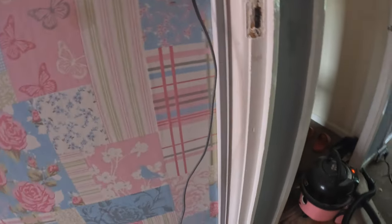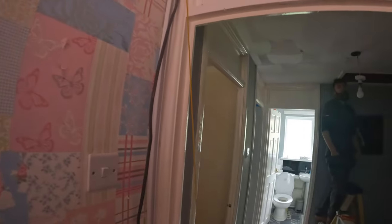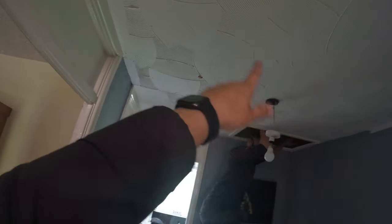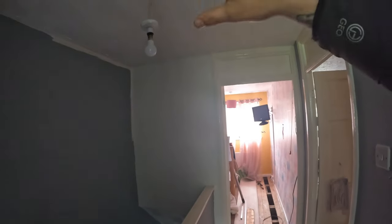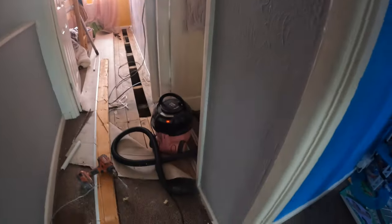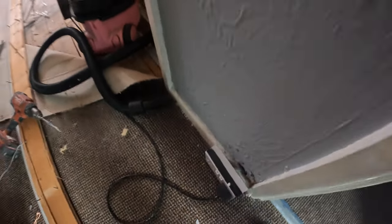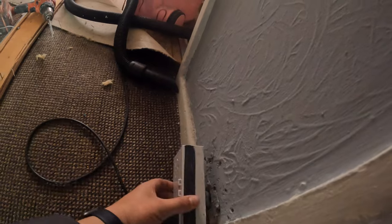He's come down the run, gone behind the skirting without damaging it — which I'm quite impressed with for his first attempt on his own — then trunking tight to the door frame and into the loft. This is going to be the interlink cable going to the pendant point. He's working backwards, which makes sense because we're changing this pendant while we're here. We can second fix downstairs, get everything put back and hoovered up, then second fix the smoke alarm connection. We're also changing this socket — look at that wiring, it goes behind the skirting into the back of the socket; you could never screw it flush from day one.